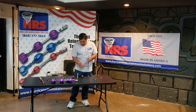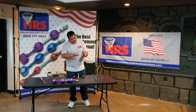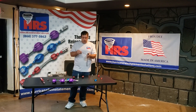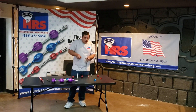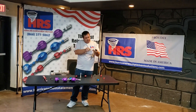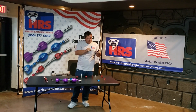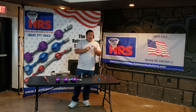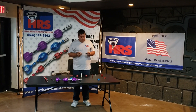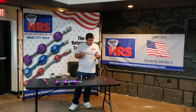Now let's get the tool back together. You have your cable, you have your head — put your head in and down. When you tighten this head up, it is imperative that you tighten it as tight as possible. Crank it down. That's why I spring-load it. Do not be afraid — everything on this tool is hardened and you will not break anything. It is important after every 5 or 10 times you use it that you tighten it up. After every 15 times, I would personally replace this cable, because you will get weak points that will eventually cause it to break.